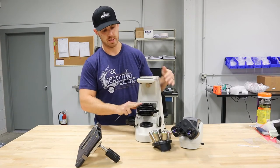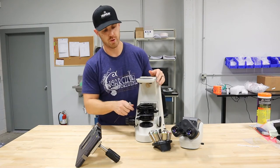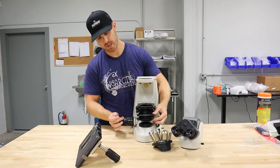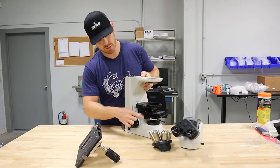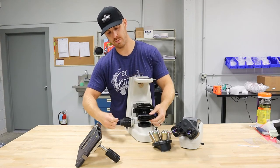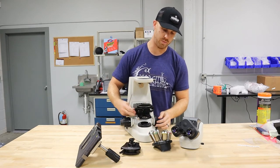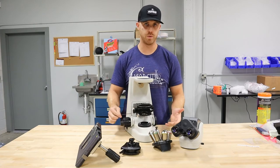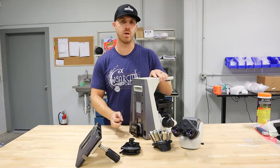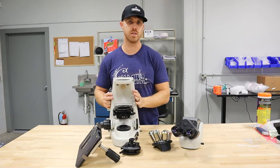Then you're going to have your substage condenser. There are going to be several different kinds of condensers. This one's a flip-out for the 1X through 100X. You're going to take that off — on this side of the microscope — put the same wrench in there and it slides right out. You want to always check the microscope for a blue filter. This one does not have a blue filter because we're using a Nanodyne LED built into the scope — we retrofitted it so you can have LED electronics in this old halogen scope.